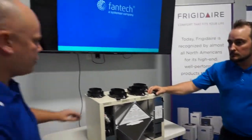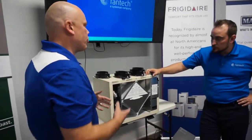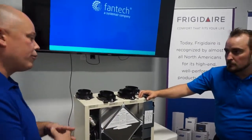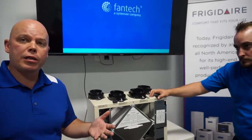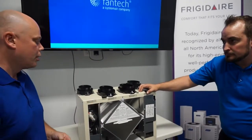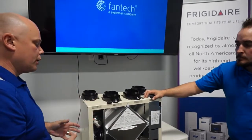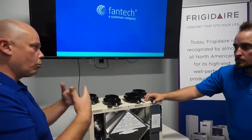Okay, I got that. Fantastic. That makes a lot of sense to me. So basically what you're saying is if you have ductwork, you've got a couple options that you can work with. Yep. If you don't have ductwork, say if you have a radiant heating system or something like that, or as you mentioned, electric, then you need to fully duct the system and bring in fresh air into the existing ports to their own dedicated runs.